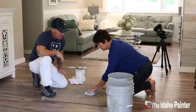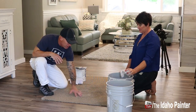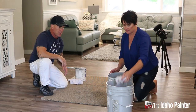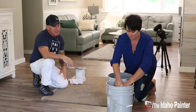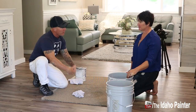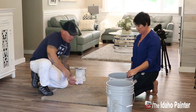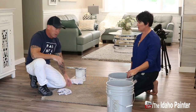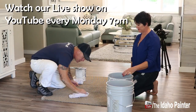We're just cruising right along. It looks perfectly fine. I can still see there's still some white — this paint was kind of a white gray, so I can still see a little bit of the color in there. I'm going to dip it into the water again. You want this thing to have enough water that it's going into the carpet and lifting it out. I'm just going to start doing these little scrubbing motions. You want to keep it localized in that area. What people have a tendency to do is start scrubbing big areas and spreading the paint spill out even farther. You want to get down there because it had enough time to soak in fairly deep, so just work down there.